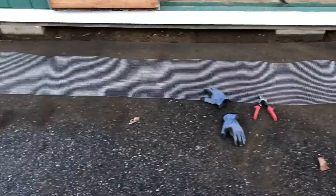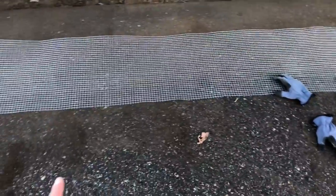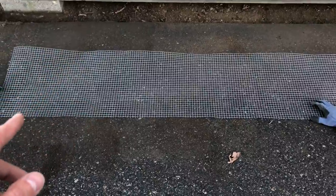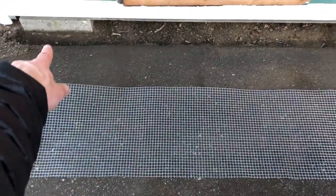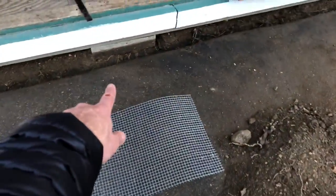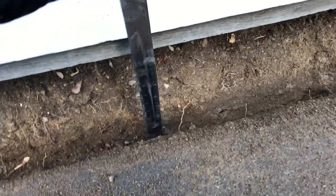Just showing the snipping — pretty easy all the way down. So I've got my hardware cloth cut nine feet long and a foot and a half wide. I will need to cut little notches out where the foundation footings are so I don't disturb those too much, but it'll be deeper in between. I also picked up some gravel for about three bucks at the big box store.